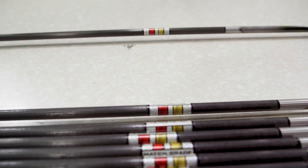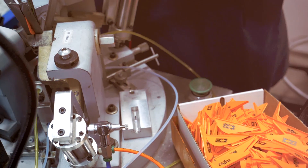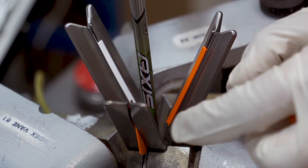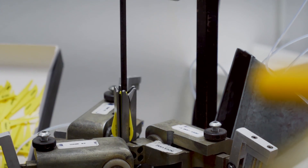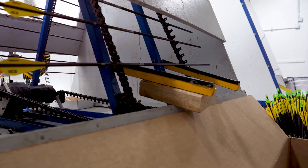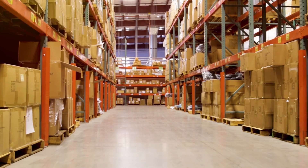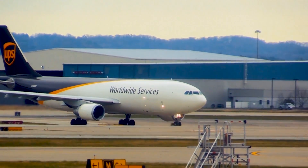Marking is used to identify, decorate, and brand every arrow. On specific product models, plastic vanes are affixed to the shafts to create a completed arrow in a separate process called fletching. Shafts are loaded into the fletching jig and the operator loads three vanes. The machine precisely dials in the exact amount of adhesive for each vane, then clamps the part in precise alignment using high pressure, which activates the adhesive. Shafts go to an automatic system to cure the adhesive, then on to final packaging after inspection. Each shaft or tube is inspected before final packaging and shipping, and the finished product goes to Easton distribution centers where they are sent to customers across the globe every day.